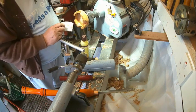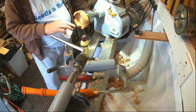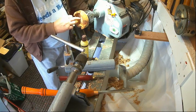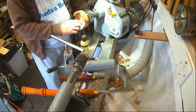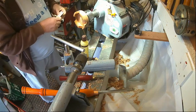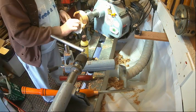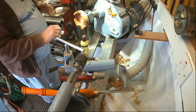Okay, let that go off for 20 minutes or so. So then buff it off. I'll then skim that very lightly because it is quite thin, just to get rid of any wax. So when I've done what I need to do with the snuffing plate, I can glue it in with some 5-minute epoxy.